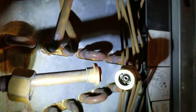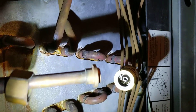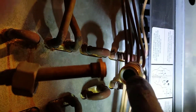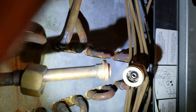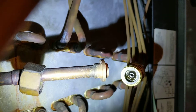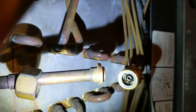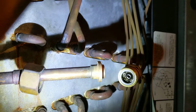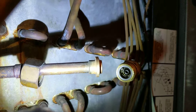Right inside this orifice there's a piece of black charcoal blocking it — right in the dead center. That's supposed to be a hollow tube, but it's plugged with black soot. What happened was the compressor was replaced maybe a year or so ago, and there's no filter dryer in the system, so that black stuff got right in there and plugged it up.